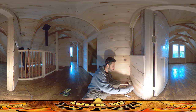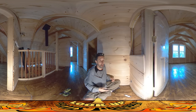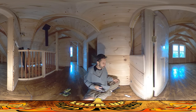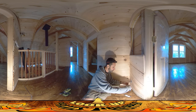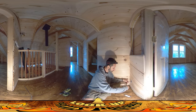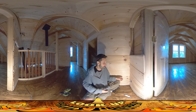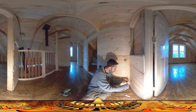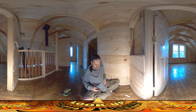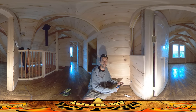First I'm going to slice the jacket off. While I'm doing this, if you care to look around — we're up on the third floor right now and the floors are pretty much done. I'm going to give them one more coat of acrylic seal. It seems like it's holding on pretty well so far. I've been a little concerned about it going over the oil-based stain underneath because the oil-based stain still seems a little tacky, but I did some post-action research and it seems like I'm going to be fine because the oil-based stain was allowed to dry for so long.